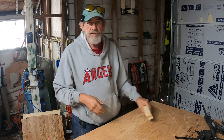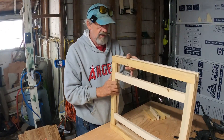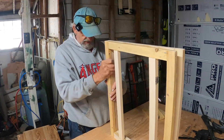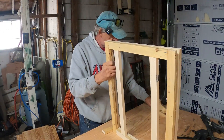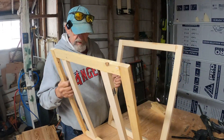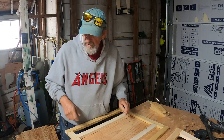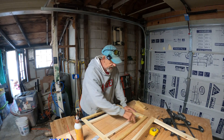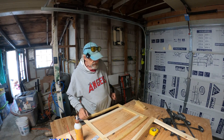I mounted the inverter to the face frame because I had no blocking behind the inverter and really couldn't mount it to the wall. So I came in here and cut myself four pieces of wood to turn this into a cube. I want maximum glue surface. My plan is to nail and glue on the back — I want the front to be removable to ease access to that compartment.